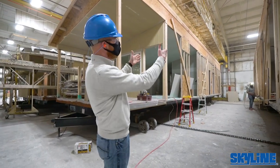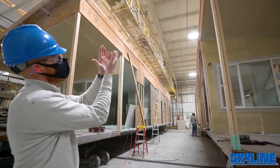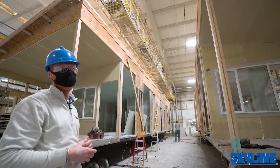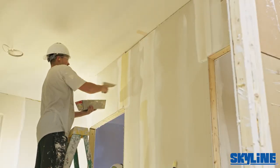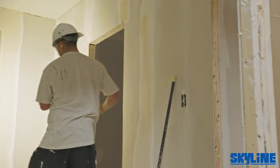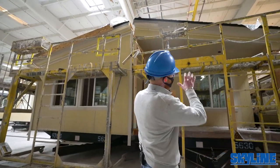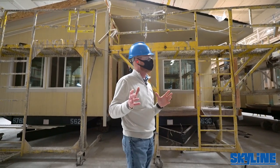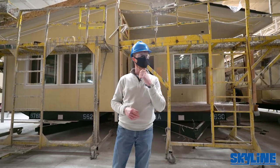Here's a good look at the continuous ridge beam — all plywood running full length, hitch to tail, with all trusses fastened up to it to make a super ridge beam. The double marriage line wall is what really keeps the box's integrity together through the set. Inside, the mudders are working double time after electricians and plumbers have done their part, closing off walls and mudding seams for texture and paint. We use a continuous ridge vent system with vented soffits, allowing minimal vents on the roof — the cement siding has perforations to allow venting up through the roof cavity.